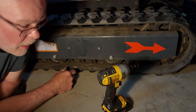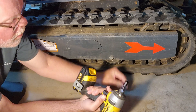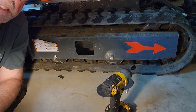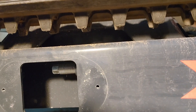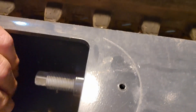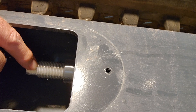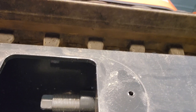I'm going to open this up and see what we got. These look like a 10 millimeter. Right there is the tensioner, and — wouldn't you know — look at that. My tensioners also are lacking a nut. I don't know if this was missed during assembly or if they just decided on this model they don't need a lock nut, but this right here is the tensioner adjustment for the tracks, and it really seems like there ought to be a lock nut on there.